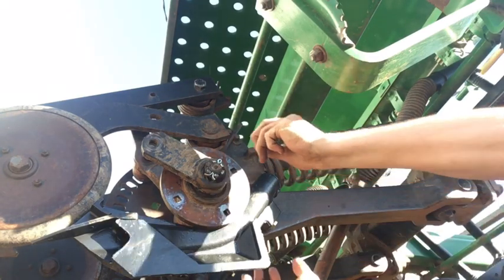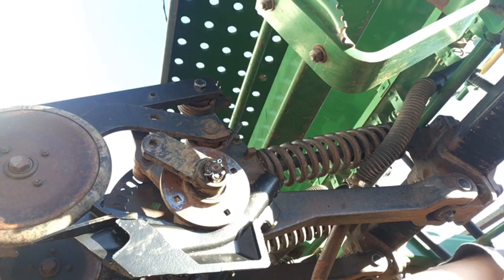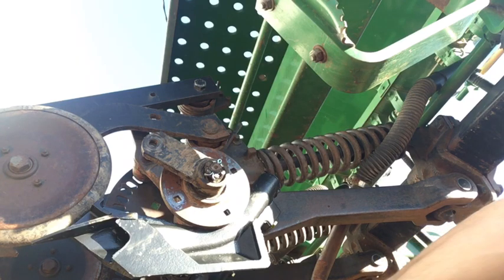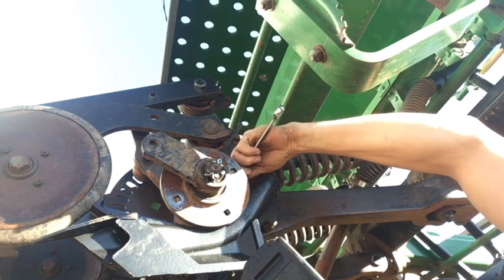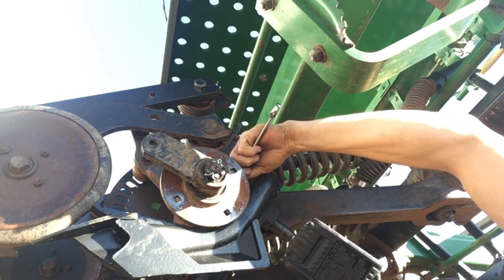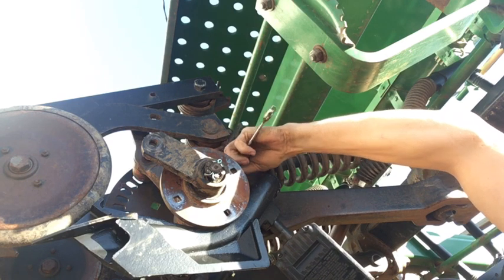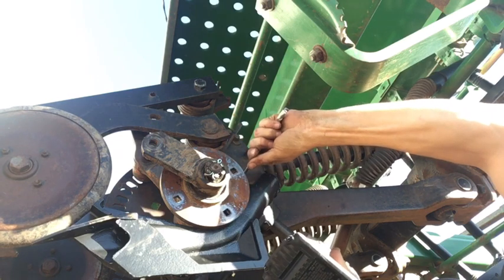Now you just put on the lock nut. And if you saw earlier, I don't buy the John Deere OEM bolts. I just buy a regular grade 8 4 1/4 inch bolt. And you don't need to waste your money on John Deere's overpriced stuff. Save the farmers money if you're going to do their stuff. But one thing, you don't want it tightened down all the way, and a regular bolt won't have that limited threading like John Deere has.